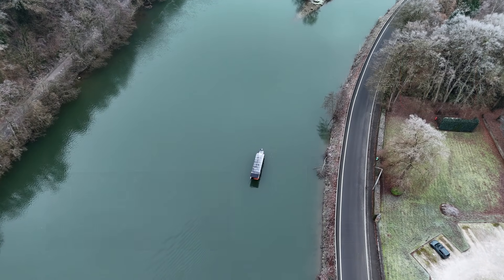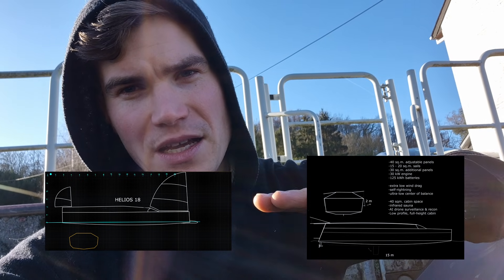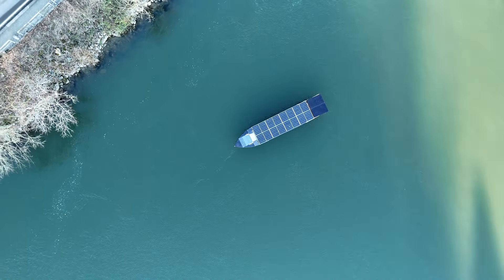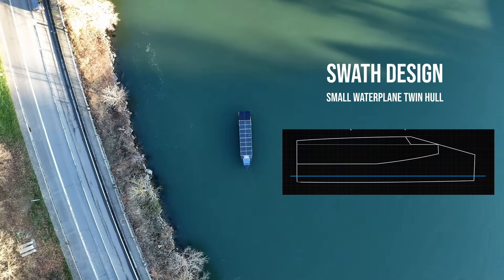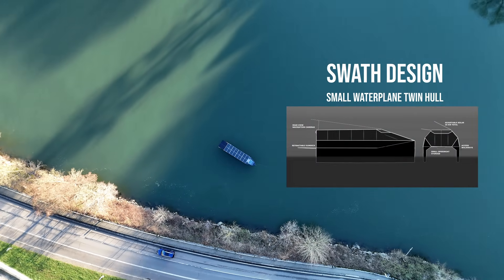Either a 15 to 20 meter long very narrow sleek mono hull that should be quite stable with all of the mass so deep down under the waterline, but the ultimate most efficient hull design is the SWATH design. The abbreviation SWATH stands for small waterplane twin hull, and that is the most efficient and balanced design for building something affordable out of plywood. We're talking about million dollar luxury yachts that outperform other similar sized vessels, but they're not going to be a million — you could build this for 100k in your backyard, or even 30k if you simply build everything yourself.